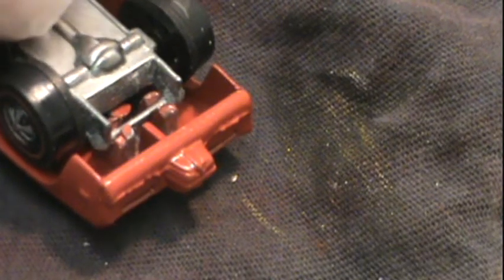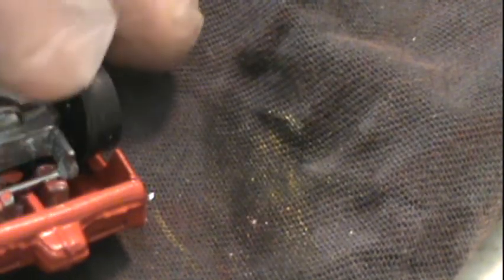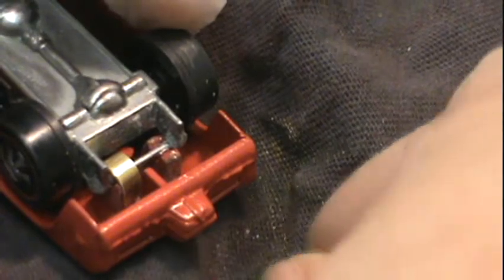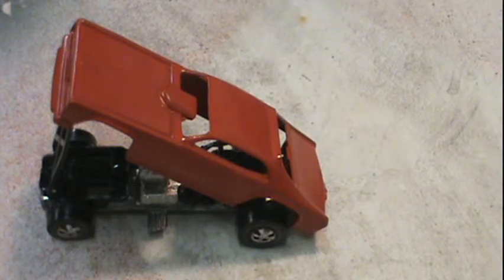On this back hinge, I ended up making a couple of saddles out of some brass strips and glued them in. Then after I got them glued in, I filled them in from the side with a little JB Weld and it turned out great.